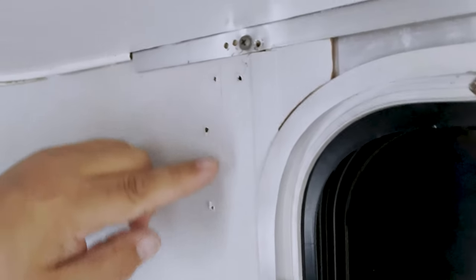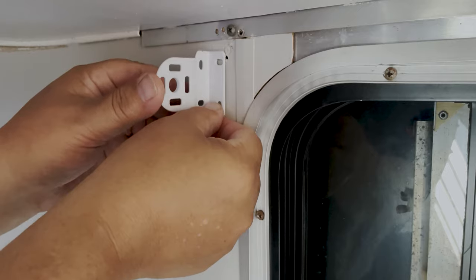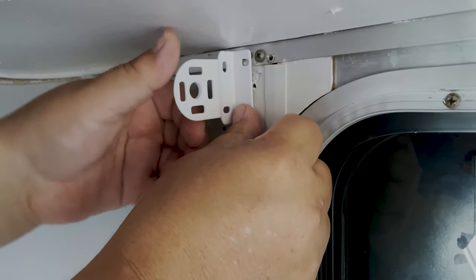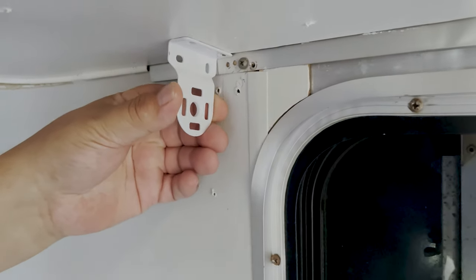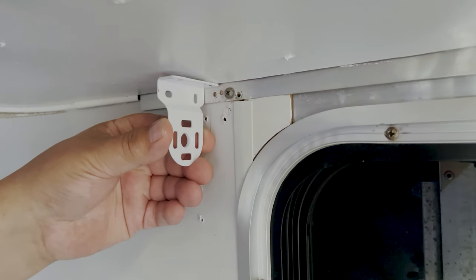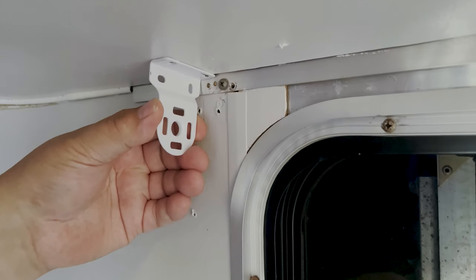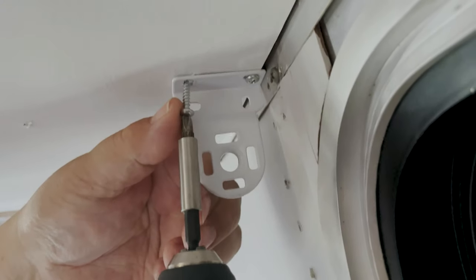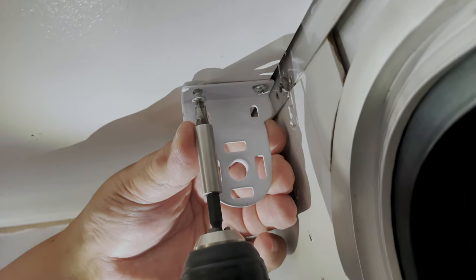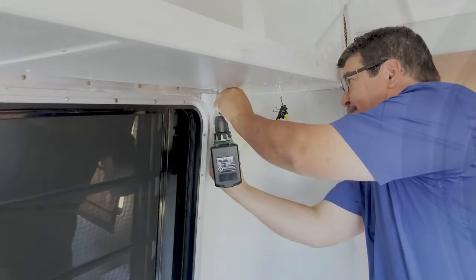I'm going to put that one inch away from the edge on the other side as well. I can mount the bracket to the wall — or even higher, or here on the frame, which I think will be stronger than the wall. So I'm going to put it right here, in line with the line I struck. I'll just screw it at that location — the screws are included with the kit. We are securing it in wood so we do not need a wall anchor. If you secure it in drywall or masonry, you'll need to use the appropriate anchor. Do the same for the opposite side.